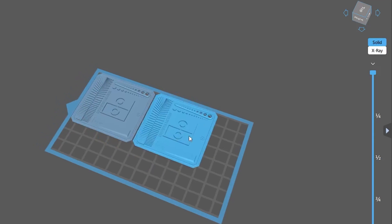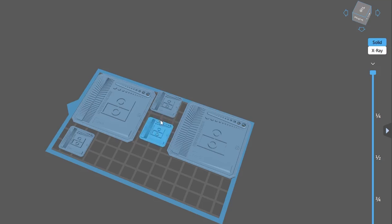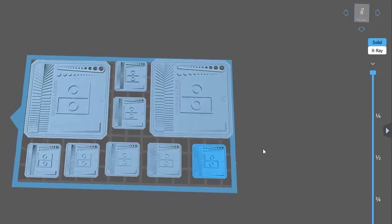After performing these leveling steps, we must do a print test. It can be a very simple and thin piece, like the one we used in the first video of this 3D printing series, so that we can check if each piece was printed correctly, especially if they are glued properly and consistently. To start printing, we must find the ideal exposure time for the resin you are using — we have already shown how to do this crucial step in one of our videos, and the link is in the description.